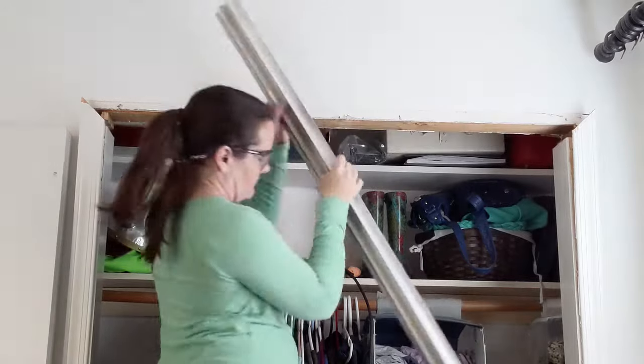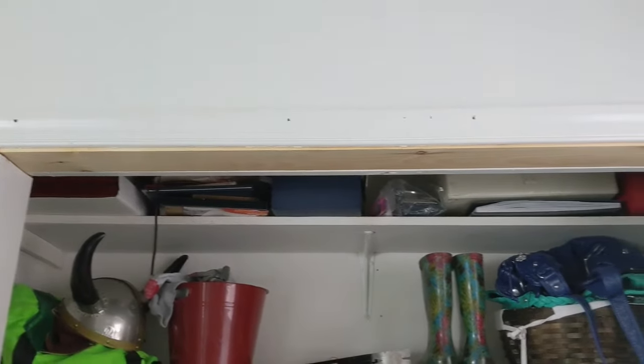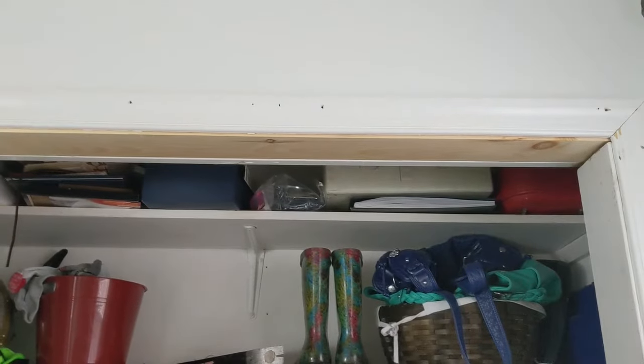The first step to transforming sliding closet doors is getting rid of all the sliding door hardware. Remove the sliding door track from your closet frame and the sliders from your door. Most of the time this just involves unscrewing a few things, but sometimes it's more involved. For my own house, the track was fully integrated into the door frame, so I had to pull off some trim to remove it. Once the sliding door frame was off, I replaced it with a 1x4 board to make the top of my door frame.